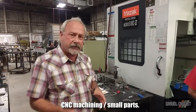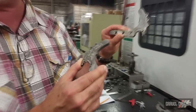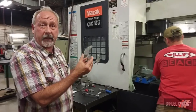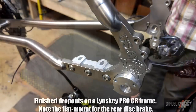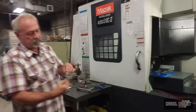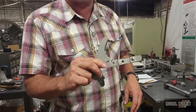This is what I'm going to call the CNC area — small parts. This is where we make all our dropouts, cable guides, etc. What we're running here today happens to be one of our dropouts — specifically the plate. This is going to be one of our road/gravel flat mount dropout assemblies. It starts life behind you at our water jet machine where we cut the blank out of a piece of plate. It comes over here and goes through this CNC process where we're doing final machining, a little engraving, drilling and tapping some holes, creating the mounting and surface area for the replaceable hanger. You'll notice this arm is a little longer — that's where the flat mount adapter bolts on, or the post mount, whichever one you prefer to use.